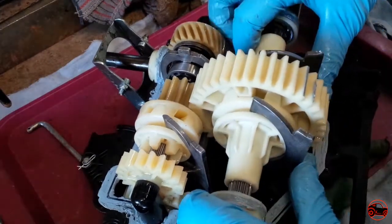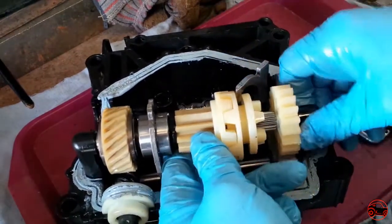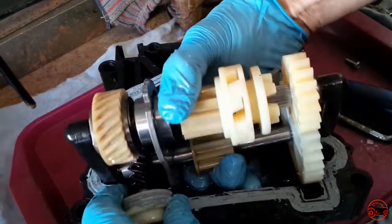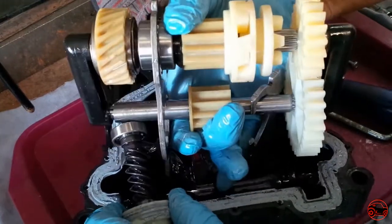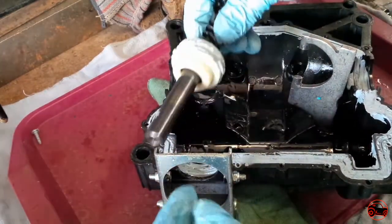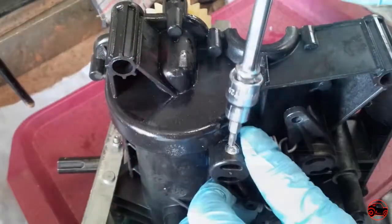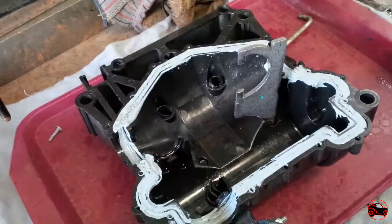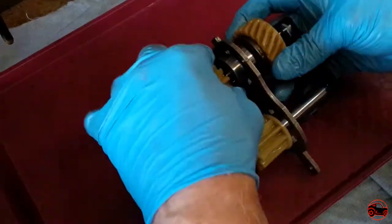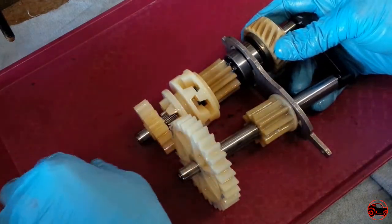Later it was time to remove the gear assemblies used for the wheels. To remove the forward assembly I had to move aside the lateral fork lever. This was the assembly that controlled the clutch and the reverse traction gears. The transmission worm gear assembly can transfer the axis of rotation by 90 degrees and can also reduce the RPM of the gear assembly. To dismantle the lateral fork lever I had to remove the screw holding the end cap. I pulled it quite hard because it was well anchored in the silicone. Since it was the main gear assembly, I paid close attention when dismantling the parts and took many notes.